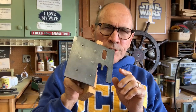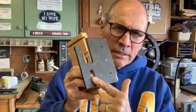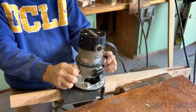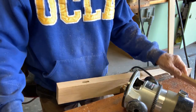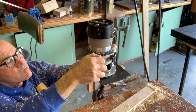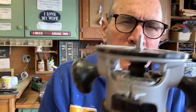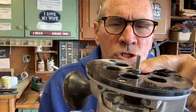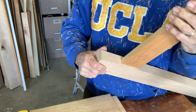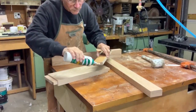This little mortising jig is pretty cool — it does both a mortise and a tenon. This side does the mortise and this side does the tenon. You use it with this bit right here, which is kind of a reverse flush-cutting bit. Once I had my mortise and tenon cut, I clamped it up, squared it up, and let it dry.